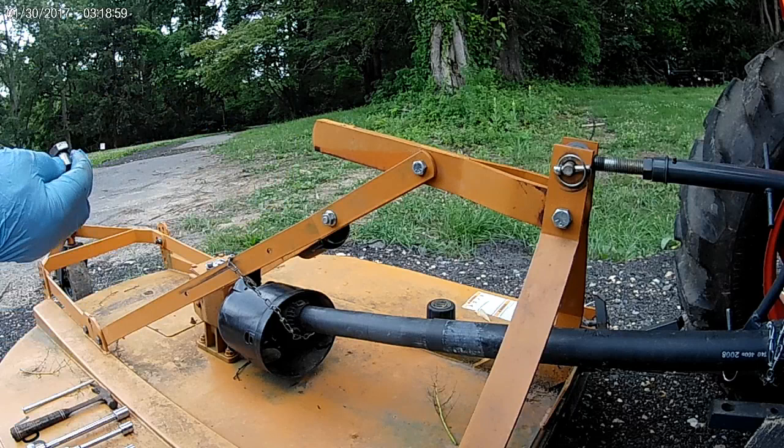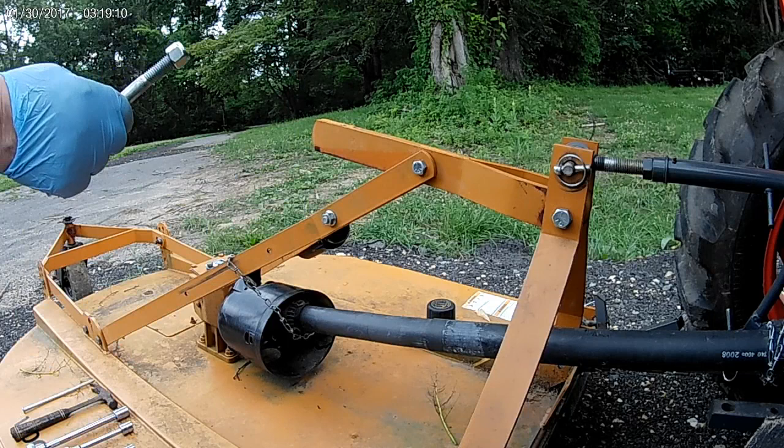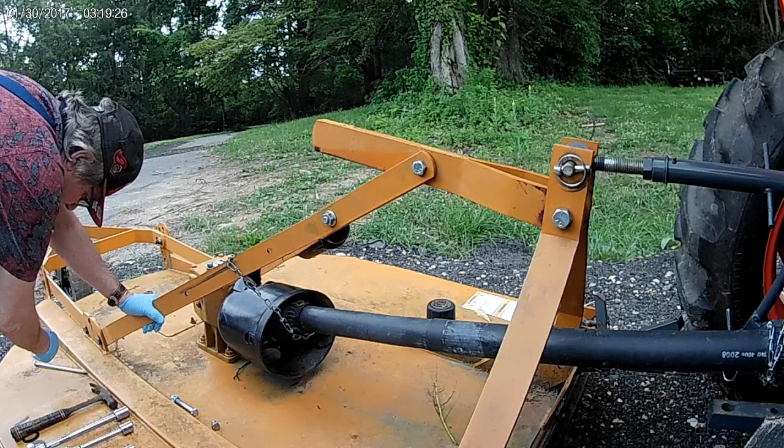Now, some of you might be tempted into buying harder grade shear bolts to try to keep them from breaking, but that's false economy — you're going to ruin your gearbox eventually, and it's not recommended. Just change it. It's a little bit of a pain to change, but that's what you should do.